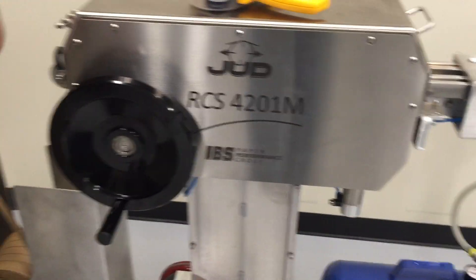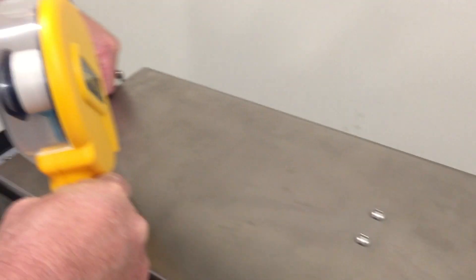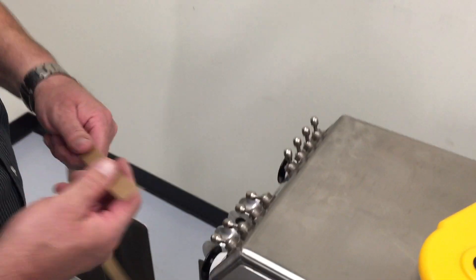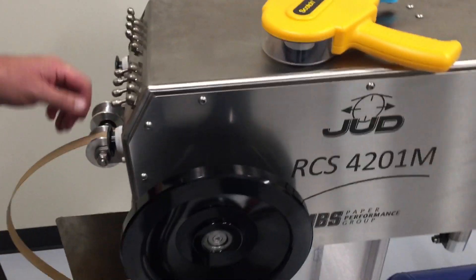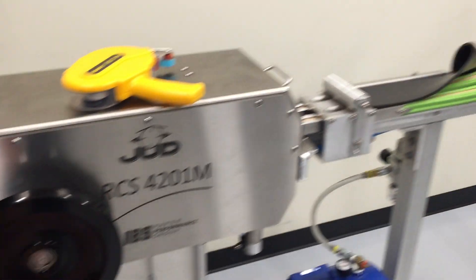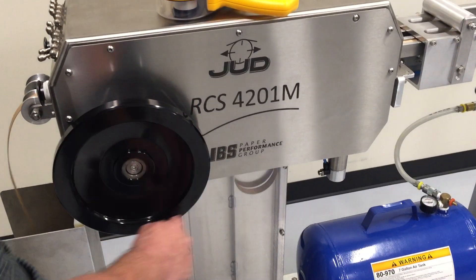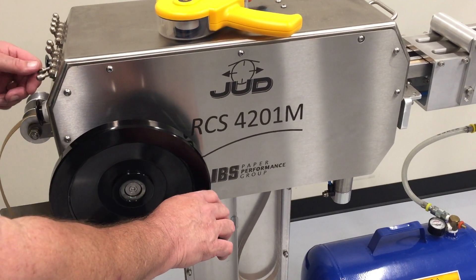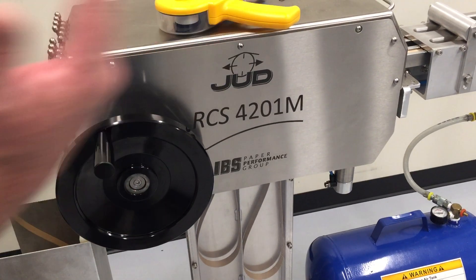I'll set up the other side so you can see the loops that I'm talking about. Again, the operator will simply place a piece of adhesive tape on the paper band. Flipping the first switch, he drives the tape out to the rail head. We make our first loop, which gives us enough tape to reach the nip when we roll the primary arms. Then the second loop, so that we have enough tape to make it all the way across the sheet.